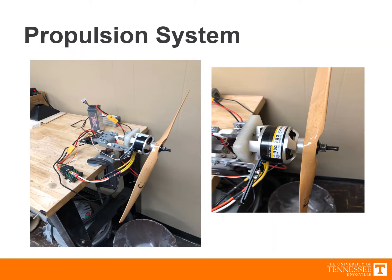The Multrafly DM5320 brushless motor was chosen for all missions. This motor was rated for 8S LiPo batteries with a maximum power of 2700 watts. The Phoenix Edge HV120 electronic speed controller was selected because of its maximum current capability of 120 amps, which was more than the maximum allowable current for the motor, 91.22 amps, and thus prevented overheating. Based on our calculations, a 19-inch by 10-inch propeller would produce the ideal performance for all 3 missions.